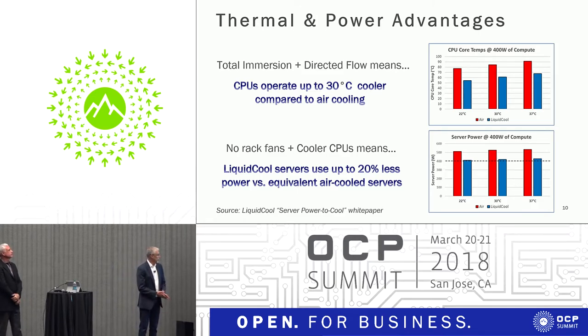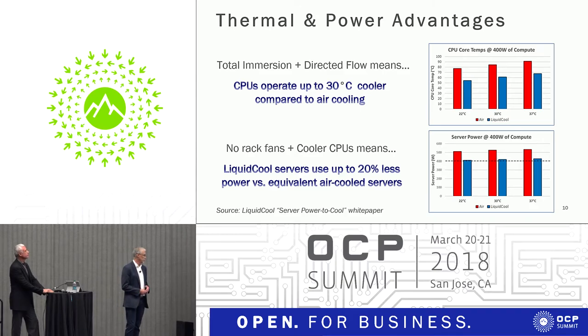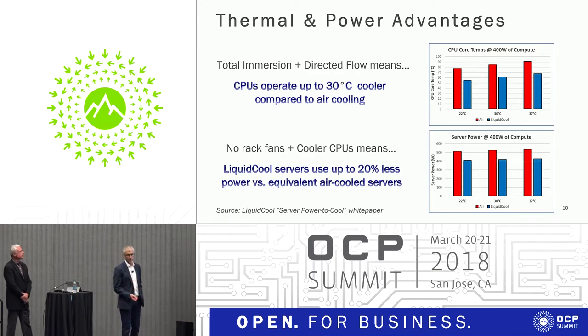This is from data we gathered some years ago, but demonstrated over and over again. In effect, the CPUs operate 30 degrees cooler in the fluid. The ambient intake fluid temperature delta-T rise is about 15 degrees, depending on how fast you flow the fluid over the GPU or CPU. There's also a power benefit — if your electronics are running cooler, you get a power reduction, plus you don't have any fans. In a server space, that literally adds up to 20%. In other areas of the market, specifically Antminers, we're achieving 10%. So somewhere between 10% and 20%, you'll achieve electronic savings.